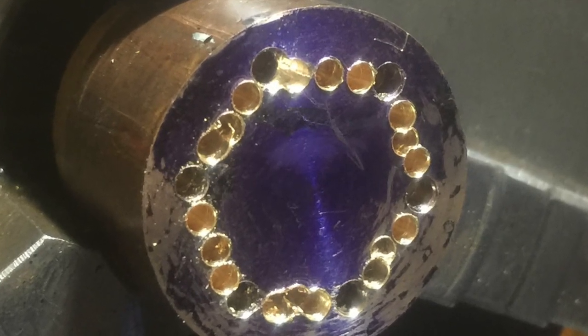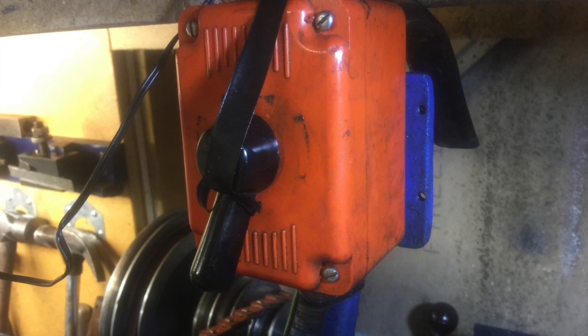That way I will have drilled holes most of the way around the hexagon and the rest can be filed out after I bore the middle out. The middle can be brought out all the way to the flat hole — the one that's in the middle of the flats.